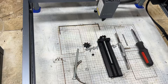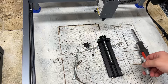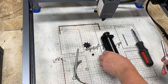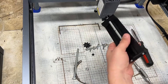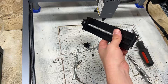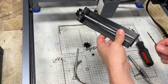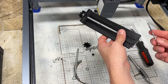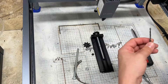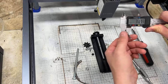If you bought the STL file, I also recommend definitely getting a tap. This is a M3 tap and you tap the holes here so you can put the screws in. For the base plate, I also recommend just drilling out a little bit — you can tap it and put the screws through like that, although you'll probably get some plastic build up. I definitely recommend drilling the holes properly. The drill bit is about an eighth inch, or a little over three millimeters.